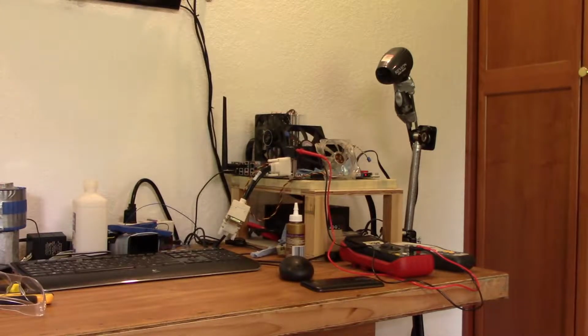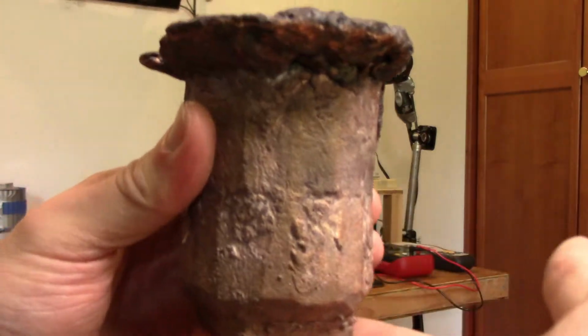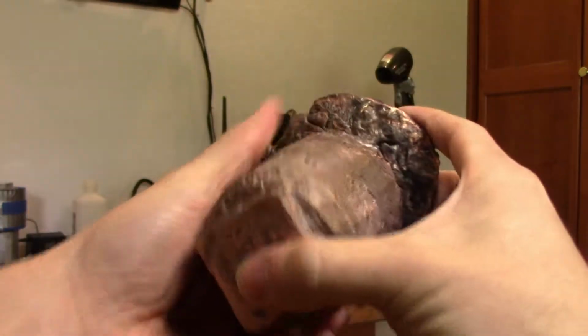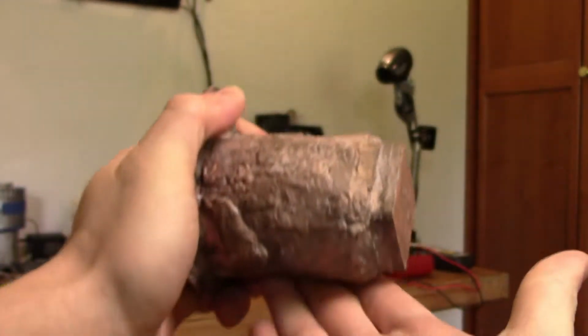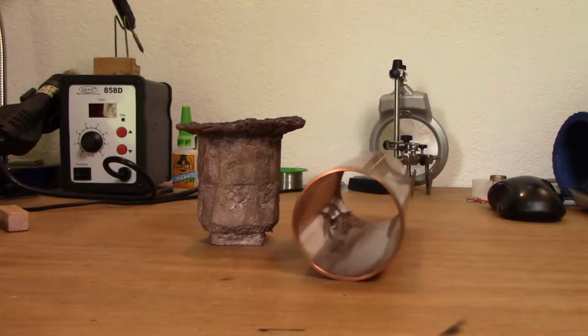To make the cylinder of brass for the Mark II, I had to cast it myself from scrap brass that I had available to me. In the end, I did the same for the copper core, but it's much more difficult. Trying to melt copper requires much higher heat than brass, and it took me about 5 different attempts before I could actually cast copper into a mold successfully. And even with the success, the quality was kind of horrid.